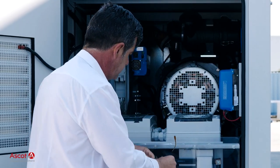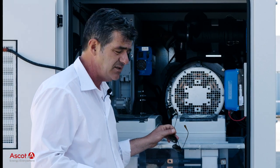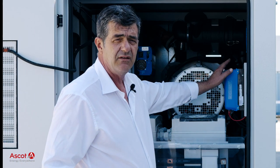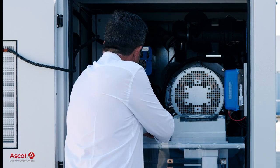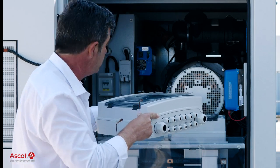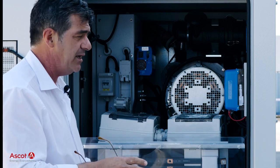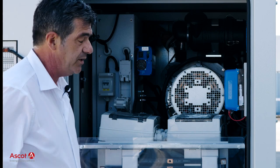the battery bank that is actually composed of 4x200 ampere hours modules, so for a total of 800 ampere hours batteries. The solar charge controller, 5 kilowatt peak each, so through the string connectors panels that we provide loose, a 10 kilowatt peak solar array can be connected plug and play to the system to provide solar, free of charge solar power.